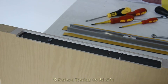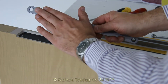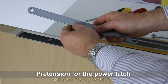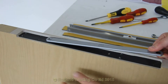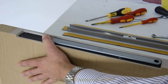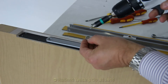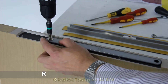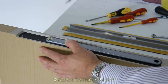When it comes to the connector bar, you'll notice it's slightly on an angle. This is for the pre-tension to make the power latch work. Fit it over this way so it comes over the door slightly, hold it firmly and drop it into place. Fix it with a screw and washer — all provided in the kit. Reverse it to centralise it and power it on.